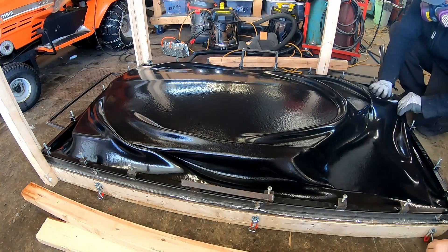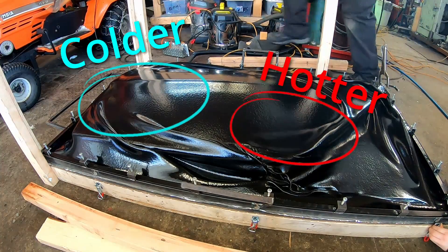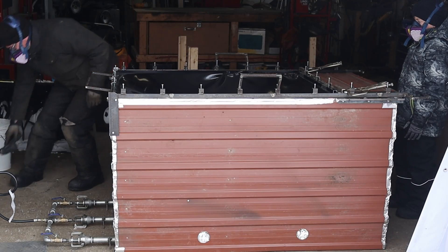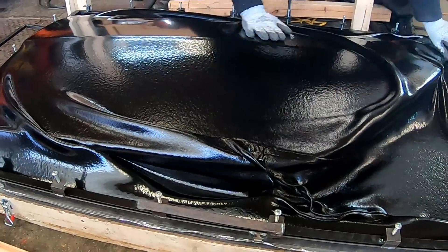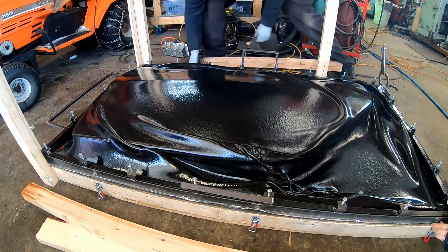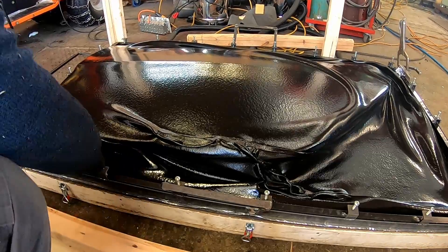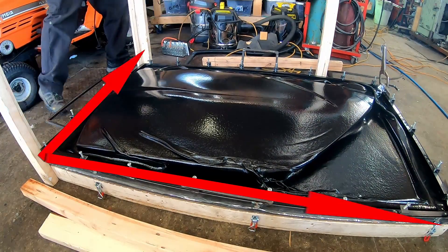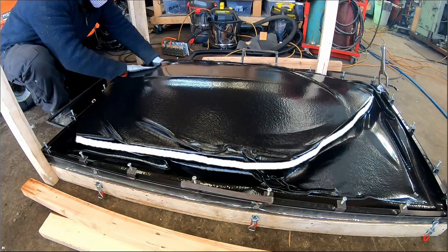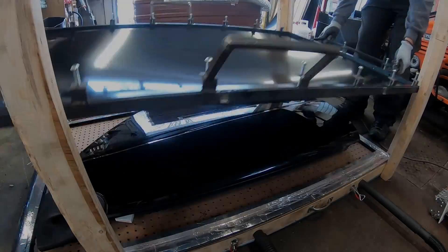The heating burners don't heat the plastic evenly from front to back — you can see it by the texture: shinier here, more texture on that side. To counter that, I'll heat the plastic as usual but rotate it at the midway point of the heating process. The plastic needs to be quite hot and melty if I want sharp edges and more detail in the forming. More heat creates a bigger belly, and I keep failing to manage all that extra skin. I think I need to work out an area-to-height ratio: the longer the part is, the higher it should sit.